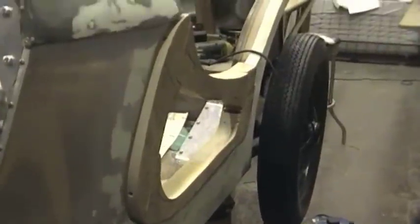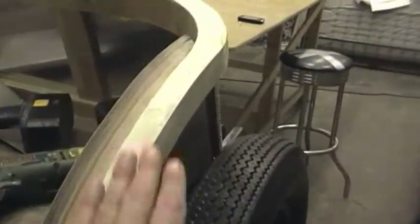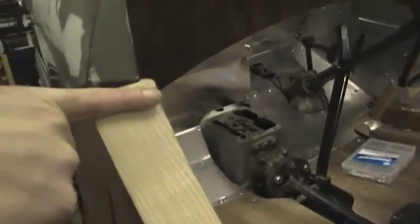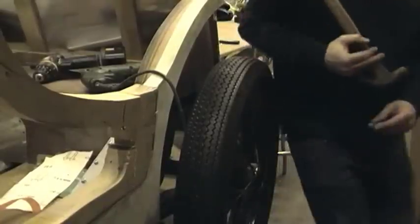The door frame at the moment is about 55–60mm thick and I need to get it down to about 35mm, which is the final thickness of the rail. The top of the door just follows this shape around, over the top of the door, comes all the way over and then meets the other side. It's the same thickness, following the curve — that gap has got to be parallel all the way round, becoming one continuous line over the door. I'm going to bash some pins in just to make sure the door keeps its shape while I transport it to the workshop.